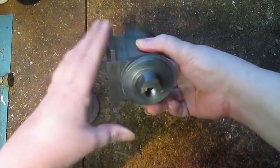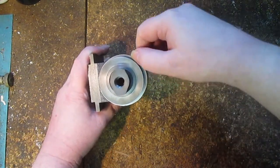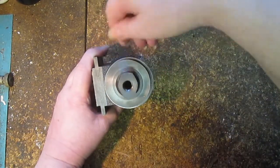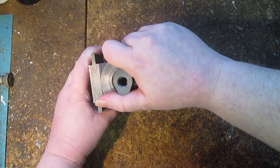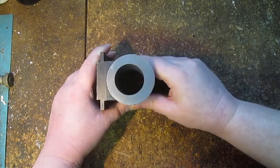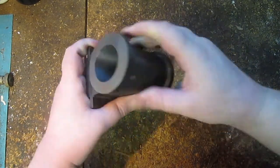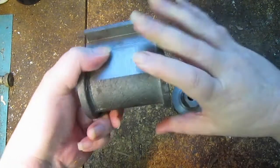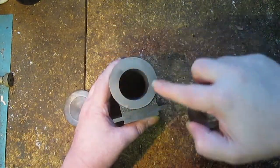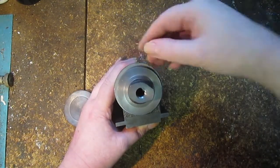If I flip it over you can see it clearly — there's a lot of unnecessary material there. My aim is to actually make a large mandrel and see if I can't turn that in the lathe and turn all of this excess material off to get it down to the same size as the covers.